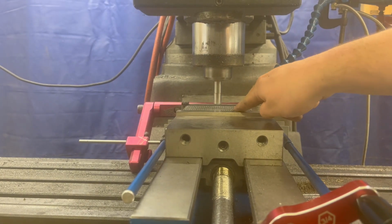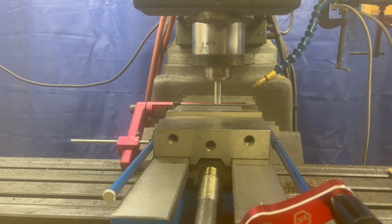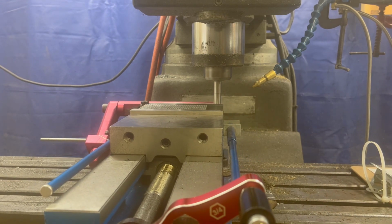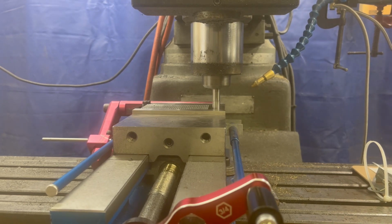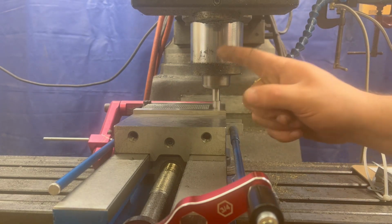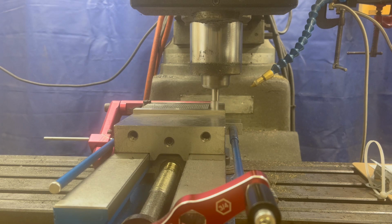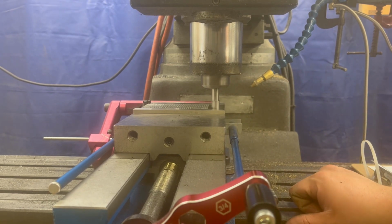So how do we do that? We indicate off a jaw. Since it's 750 from the bottom, we're going to come to the bottom of our part. We've already zeroed our X, so we haven't lost it by doing this. We're going to come down in line with the jaw. That's where we'll meet. Give her a flick. Not more than once, or you're playing with it. So we zero Y. That looked like it moved over too much. Be real careful. Edge finders are highly accurate if you are accurate at using them. They can be insanely inaccurate. So we check it a few times if we're unsure.